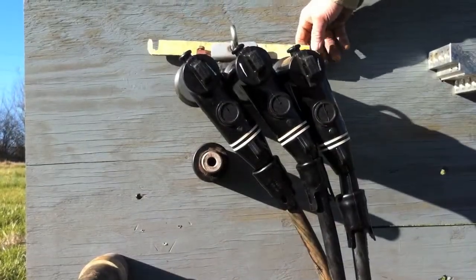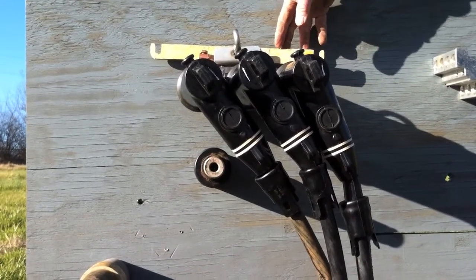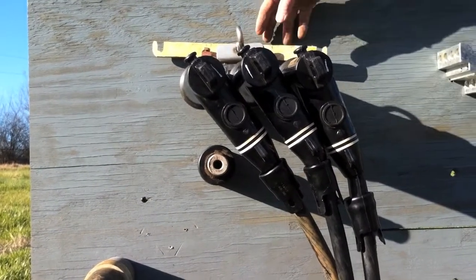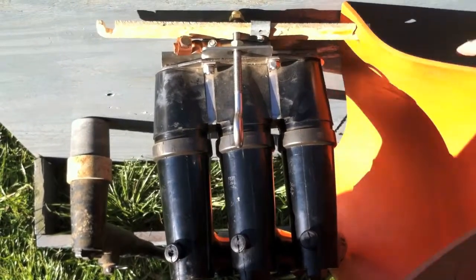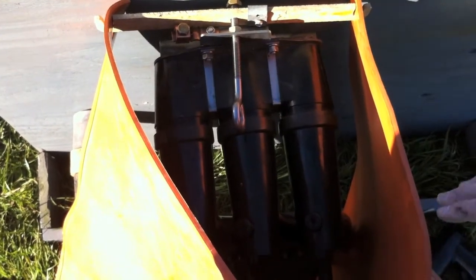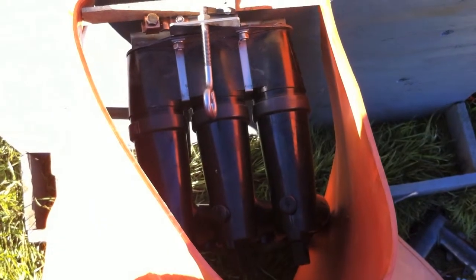I'm talking to a manufacturer about building these parts. I don't have anything yet, but we're working on it. There's an attachment onto these junctions with this new underground system, and it'll be sitting here. It's already going to be high anyway. You just take your blanket, flip it right over your brackets, and it covers your cables. It gives you a lot of cover for working on the secondary side of your transformer if you need to, with this also.